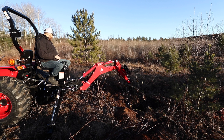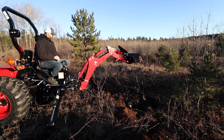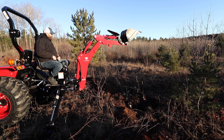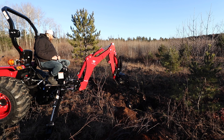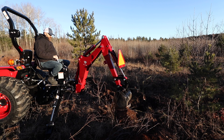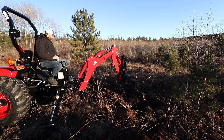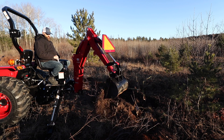You can see the backhoe has enough power to actually move the tractor with the digging force — you could actually lift up the rear end of the tractor with the backhoe, though I wouldn't recommend it. You can definitely feel how much force you have both curling, pushing, and going side to side. For going side to side, the cylinders are typically a bit smaller than the up-down cylinders, so I'd limit how much force you use going side to side compared to the lifting cylinders on the arm itself.